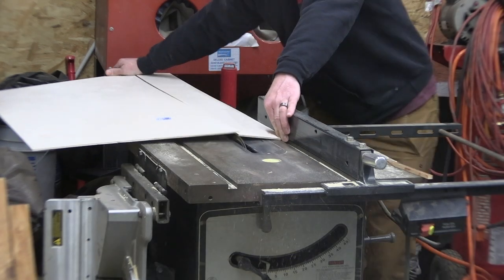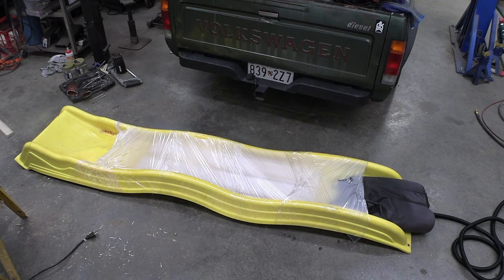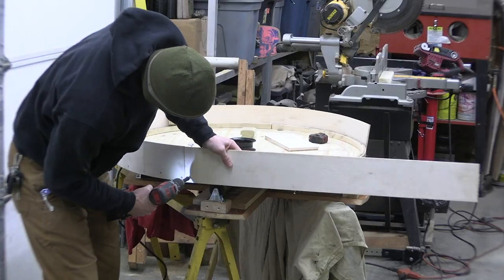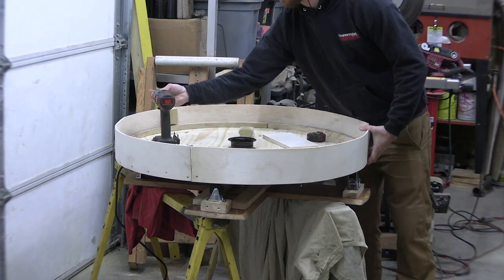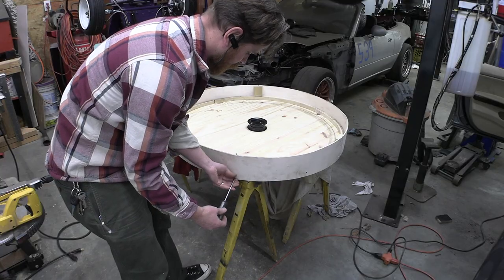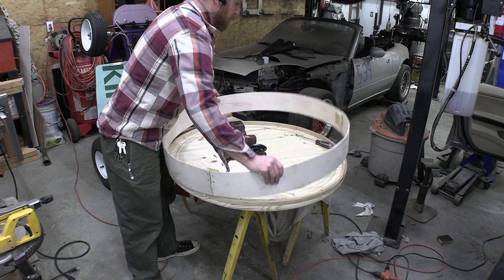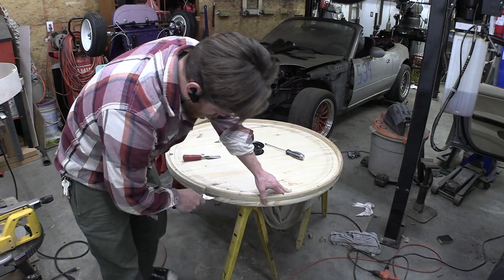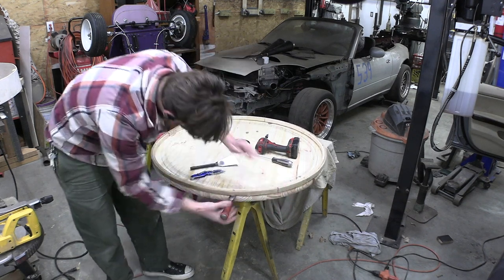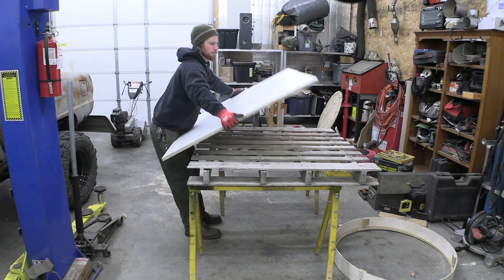I'm going to use some quarter-inch plywood to form the skirt which goes around the outside edge of the platform. I'll need to steam bend this plywood as well, but it wouldn't fit inside the box I built so I had to improvise. With that the structure was all done — but then I had to rip it all apart and start over. I let the project sit for a week, and when I came back the edge-glued tabletop had warped even though it was sitting inside a climate-controlled garage with no temperature or humidity fluctuations. So I need to start over and this time build it with engineered wood that won't be nearly as prone to warpage.